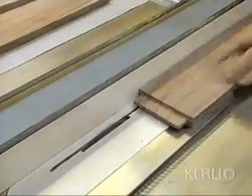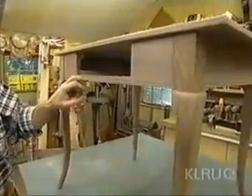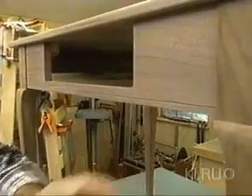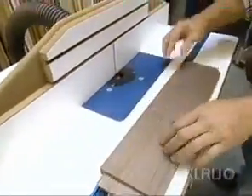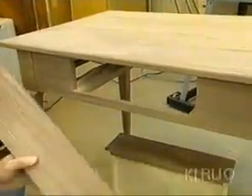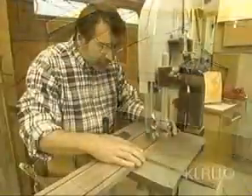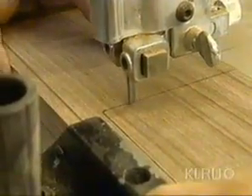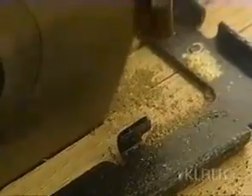Take another look at the prototype - there's a decorative groove right at the bottom of each rail, and I'll do that at the router table. I've installed this decorative plunge bit in my router. There's a cut out in the front rail to make the drawer opening. Here's my blank with the layout. I'll make the cross cuts on the band saw and the rip cut with a small circular saw. I've loosened the depth adjustment on the saw, set it over the line, make a slow plunge cut in, then go to the other side and finish it off with a handsaw.